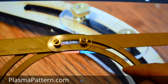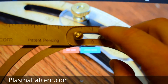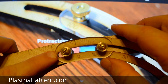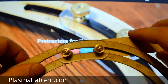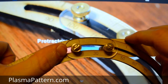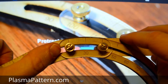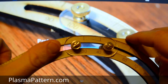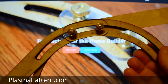Starting with the 0 to 90 side, if we were to do a 35 degree angle that would be in this area. You'll see the four tick marks on the right hand side and the four tick marks on the left hand side. When you push this side you're going to allow it to bottom out on the other side and push it around. Keep pushing until you get to 30 in the center — that long tick will match up with 30 degrees. Then go plus 1, 2, 3, 4, and 5 and you'll see 35 degrees right there. So you'll have a 35 degree angle mocked up.